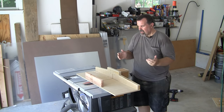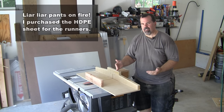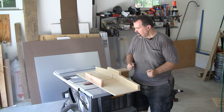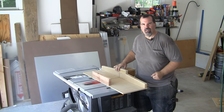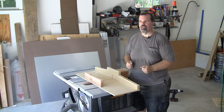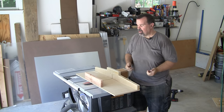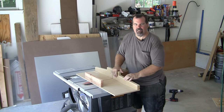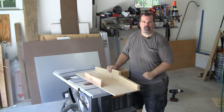To wrap it up — very easy build, all from scraps. It's pretty short, but it's really all I need right now as most of the stock I'll be cutting is only about six inches at most. It slides really, really smoothly. I did the five-cut method to test it — put my calipers on it, came out perfect on both sides, so using the framing square I was able to get it dead on. If you like it, give me a thumbs up. If you see anything I didn't do right or could have done better, please let me know — I'm learning this as I go. If you want to follow me, subscribe. See ya.